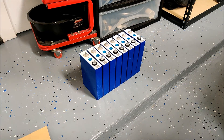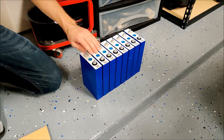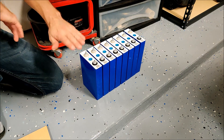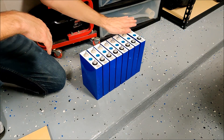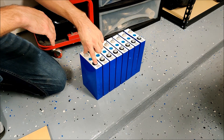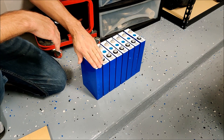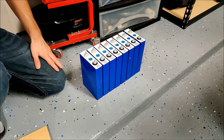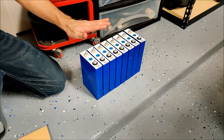The first thing I'm going to do with these batteries is hook them up in parallel for a few days, just to balance out and let them equalize before I start charging them. I have all the positives on one side, all the negatives on the other side. Connecting all the positives and all the negatives puts these batteries in parallel. If one battery has a little more energy than another, it will give its extra energy to the others until every battery is perfectly balanced. It's not charging them, it's balancing them.